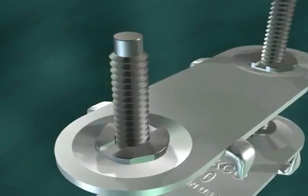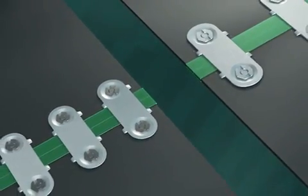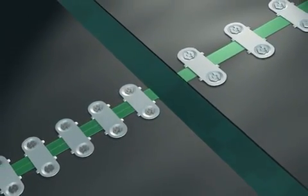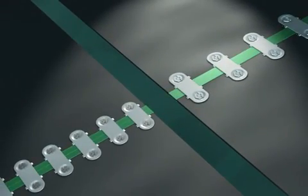These fasteners use thinner, high tensile strength bolts. This means smaller holes can be drilled through the belt during splice installation, cutting fewer carcass fibers. Additionally, because the newer style 190 and 140 fasteners are more narrow than the number 2 and 1.5, more of them can be used across the splice. This again creates a stronger, more dependable joint.